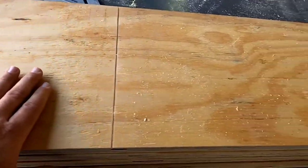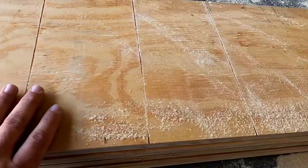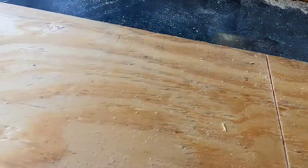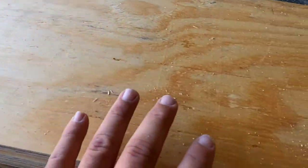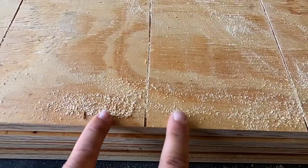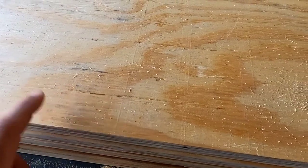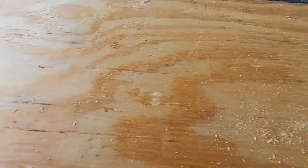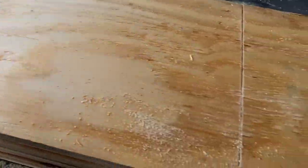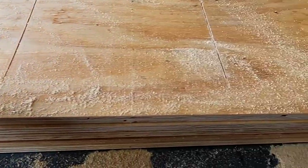So we have fulls again, you have doubles, here's your halves, fulls, doubles, and halves. So if you don't want the same amounts, you can change it up. You can obviously make these into full gussets. You can not cut this line, leave this as a full gusset, or vice versa. Turn this into 6 by 12 half gussets. So depending on what you want, if you want the same exact amount, you just have your lines already there. No need to mark it, and you continue your cuts.